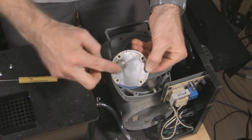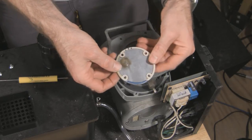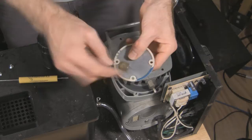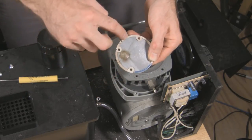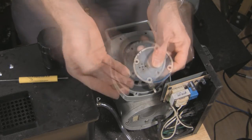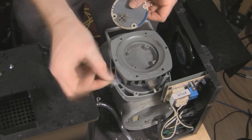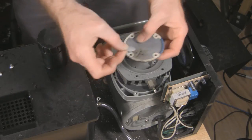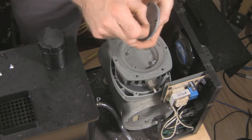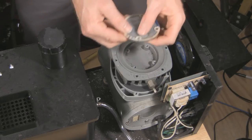Now I'm going to gently remove this inside plate and flip it over. You'll see there's a lot of distressing going on here. This is where the air comes out of the cylinder and actually feeds to your air hose. It's got a paper gasket along the top. Remove this old small gasket — the clear one. Clean off any schmutz that's inside there. Take the brand new small clear rubber gasket and put it in the hole. Make sure that it's all the way through on the backside. Now reassemble.